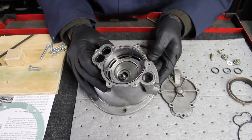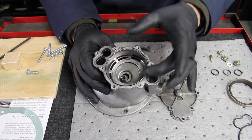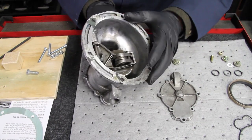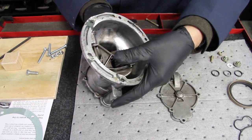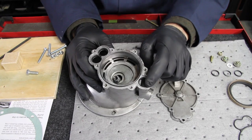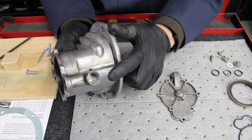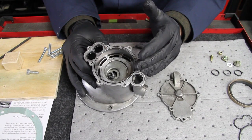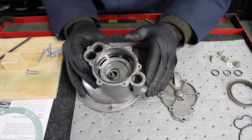This pump is located on the left front side of the engine. It's a piston-style pump, meaning that it uses an up-and-down piston motion to create vacuum. There's a cam that runs off the front timing device on the diesel engine that pushes down on this roller bearing, giving it the pumping action. Then inside, there are three check valves located in these three holes, as well as a check valve located right here. These check valves have to be opening and closing at the proper time as the piston is moving up and down in order to create steady vacuum.